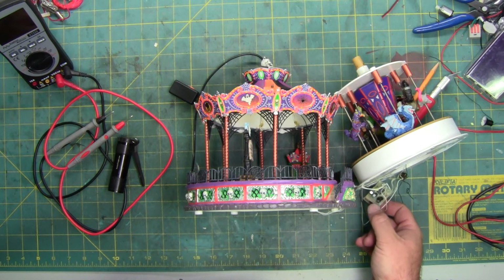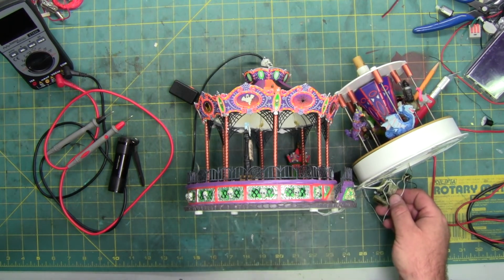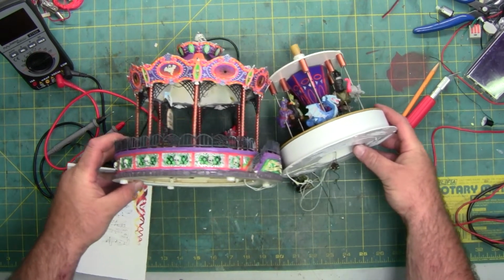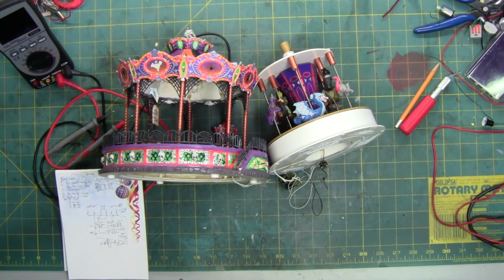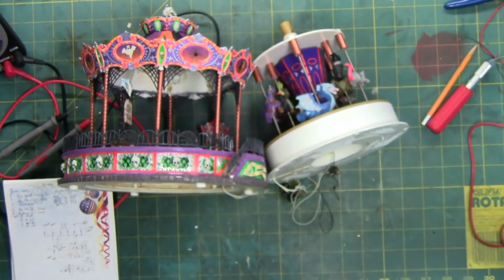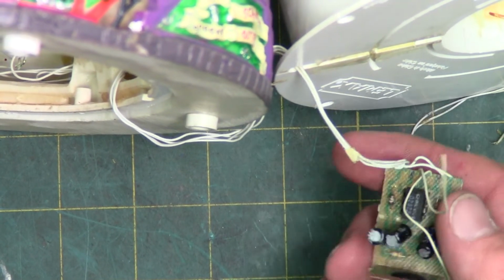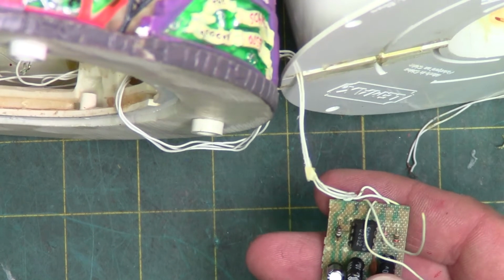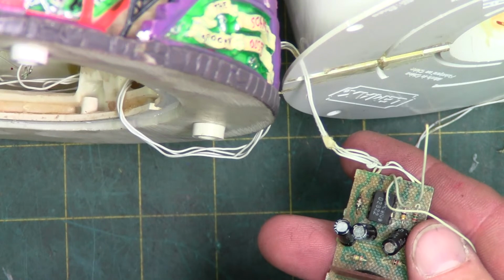in case you have to replace this for some reason. You open this up and it's melted. It doesn't say anything on the side. There's 2 resistors this side of the chip. Let me see if I can zoom back down again. It'd probably be easier for you all to see if I zoom. There we go. Alright. Get this piece in focus. So here we go. Burnt. 2 right here. And then there's 2 more resistors right there.